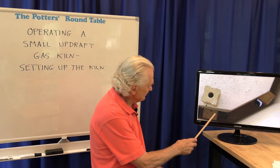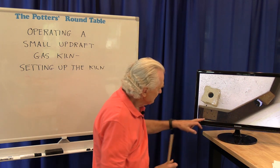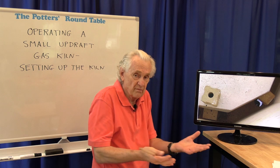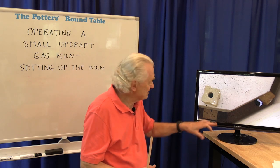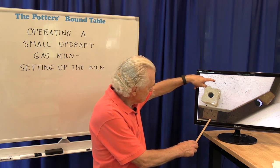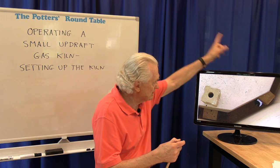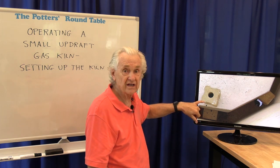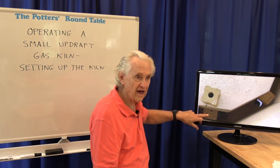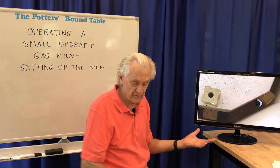By the way, this is an aside, but the way I supported this shelf, the bottom shelf underneath the one that this is resting on, is I wanted to transfer a lot of the load to the outside, closer to where the metal frame is, because the bottom of the kiln, the center, is not supported. So instead of using kiln posts just on the outside, I have three large refractory bricks, 9-inch long bricks that go in about this far. This is the end of a brick that's supporting the bottom shelf, and I used 3 of them, sticking out like this so I can tell where to put the kiln posts. When I look down into the kiln and I'm adding additional shelves, I want to line them up to go over the support. I know where the support is, and I can line up all my posts, such as this one, so that they're over the support in the bottom of the kiln.